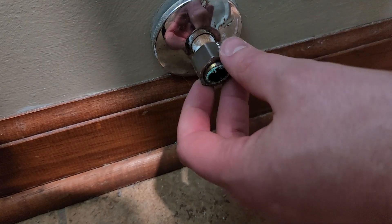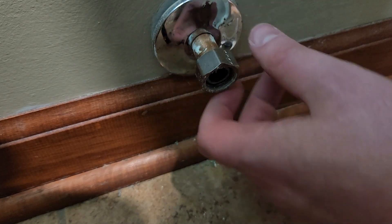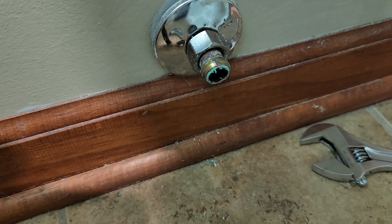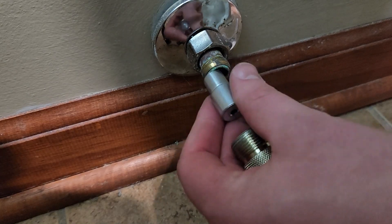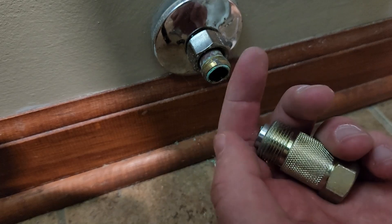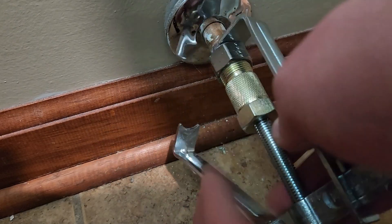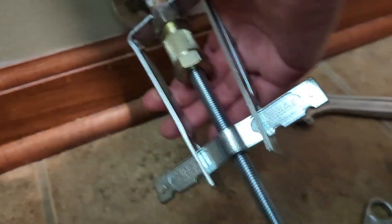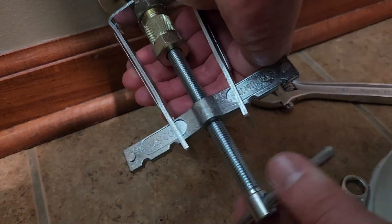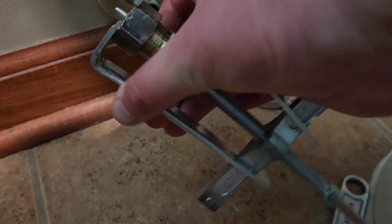We got a little bit lucky and I was actually able to pull off this copper ring by hand, just grabbing the back nut and pulling off the compression ring. But I've had a few of these stick on pretty good. So I'll go ahead and show you how to use a ferrule puller. You've got the adapter here that will ground to your pipe — put that in your ferrule puller, ground out to that pipe, get adjusted properly. Once those back hooks are around there, you would simply twist that off and you've got that copper ferrule.